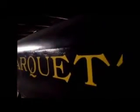And this one is a little bit more modern, because this one combines air with the sand. It used to be in the real olden days, like even the late 1800s, early 1900s, it just had the tube coming off here from the sandbox to release it just right in front of the wheels. This one actually has a sand squirter, and a high pressure air line flows through, opens the valve, and squirts the sand through the squirter in front of the wheel. This sandbox holds about 1 ton of sand, and you access it through those hatches on the top.